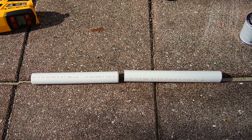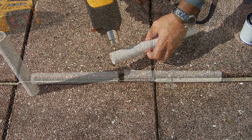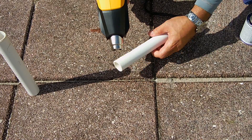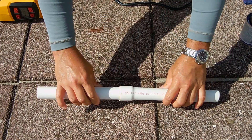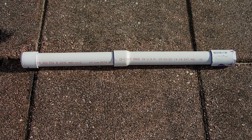Here is a brand new piece of 1 inch Schedule 40 PVC pipe. I cut it in the center and I'm going to thermoform the coupling. Once that's done I'm going to put on the end cap, the coupling along with the bushing inside the coupling that reduces the 1 inch pipe down to a half inch female thread. The same purple primer and OD clear cement was used for this pipe.